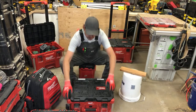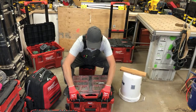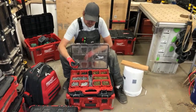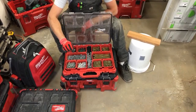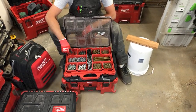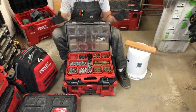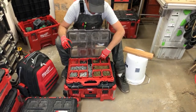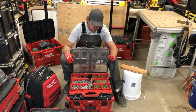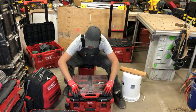On top of the main fastener box I carry a backup/specialty box with a variety of smaller fasteners: 10d hanger screws, 10d hanger nails, cortex plugs, T-bits and other driver bits, ledger locks and bolts for attaching ledger to the house, GRK 3-and-3/8-inch screws, and small headless GRK screws — really good for cedar and trim carpentry. It's my specialty box.